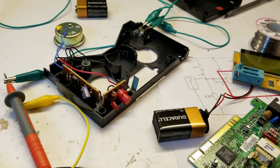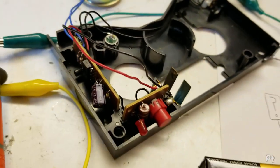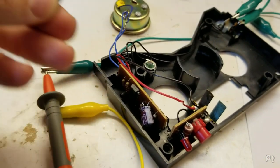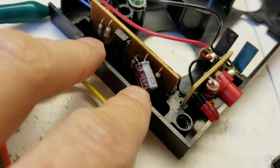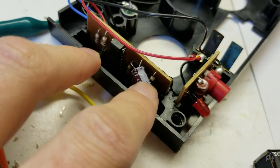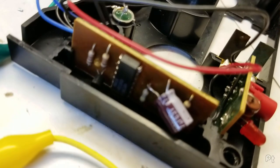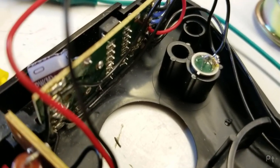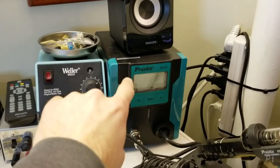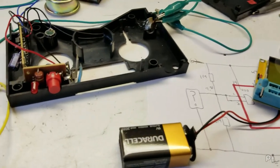I think I got it working just fine. I went on a whole tangent trying to figure out if this was broken because I was testing it and it wasn't working correctly — because I'm stupid. In the end it was just what I originally thought: a bad cap. It's always bad caps. So I found a 47uF to replace it — this is way overkill, and it's radial while the original is axial, but I just tacked it onto the edge of that resistor. It's working now.